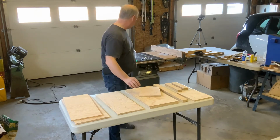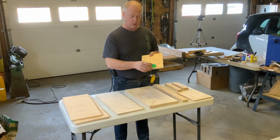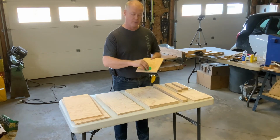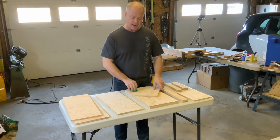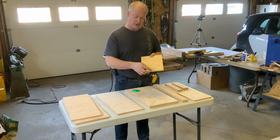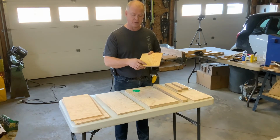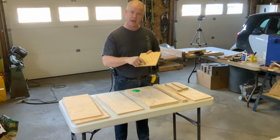And our reducers, or our entry blocks, will basically screw on there. So the hole that goes through is a 1-inch hole. We're gonna drill a 1-inch hole. And I brought that up from the bottom, an 1 1/4 is what I brought that up. So we're gonna take this over to the drill press and we're going to use an arbor bit